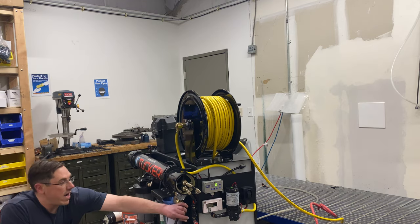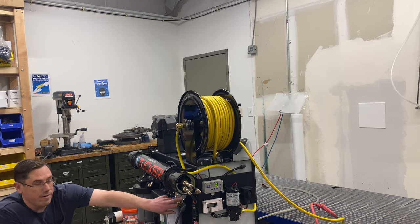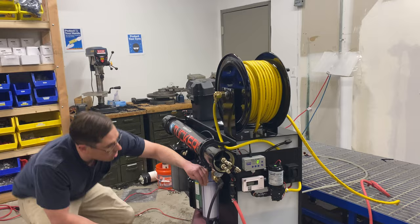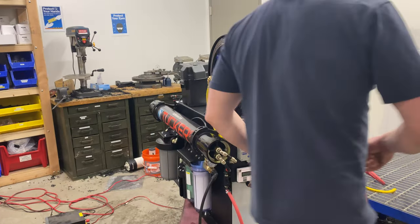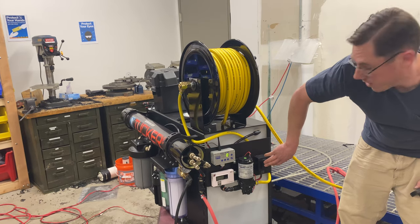You hook up your tap water here. You can monitor what your tap pressure is at this gauge. If you're running low pressure, you're going to be making water at a slower rate. So as you're making water, you always have the option to turn on your front booster pump with this switch.